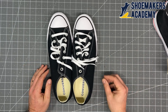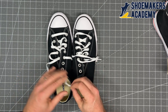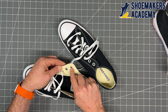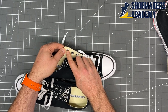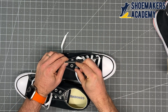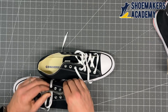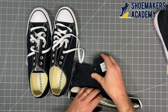This is a vulcanized shoe, so the whole shoe goes into an oven. The laces are put in afterwards so they're fine. Because the shoe has metal eyelets, you want to check the back of the eyelets — if the rivet face post isn't quite the right length, the back of the eyelet will split. These all look good. I'll check the medial side rivets and vents too — they all look good. After making 100 million of these, you'd think they'd have figured it out.